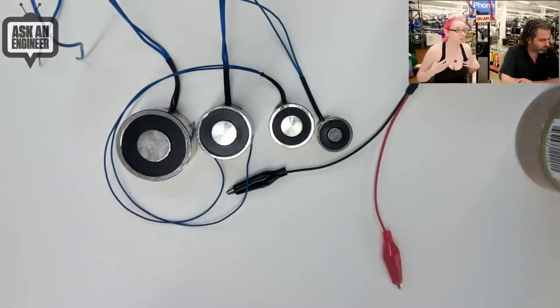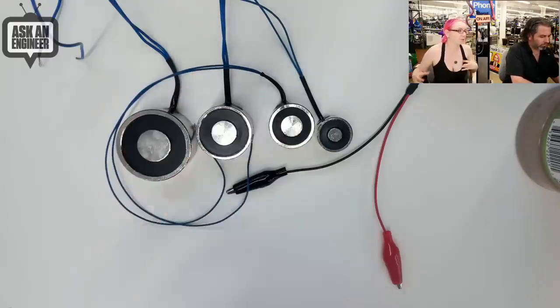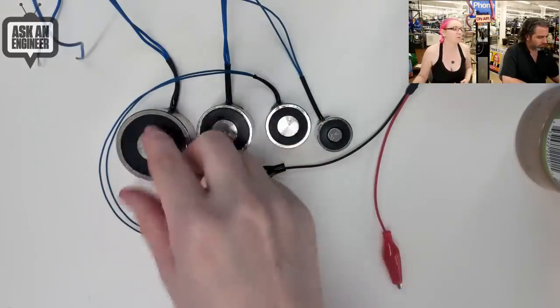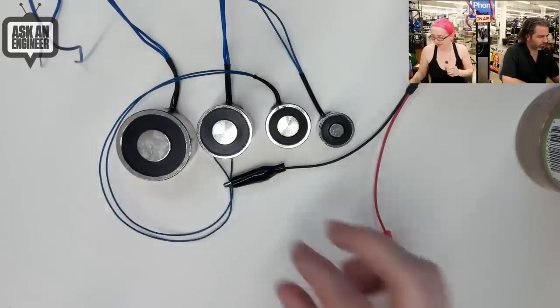It also depends on what you're picking up, how smooth it is. Like, if it's a perfectly smooth steel cube, it's very ferromagnetic, I think maybe like half or one-fifth of the hold rate, but you'll have to experiment to see how much you could pick up. Of course, if you have something that's oddly shaped, the bigger ones will enact more force, so you'll be able to pick it up more. But each one gets more expensive because they have more windings and take more power. I think it's like 1, 1.5, 2, and 3 watts or something like that.